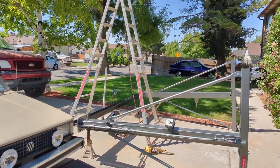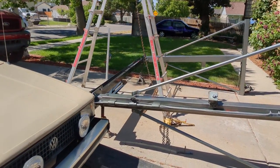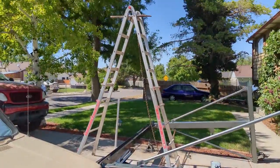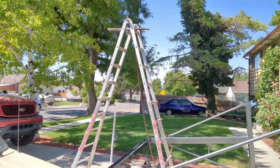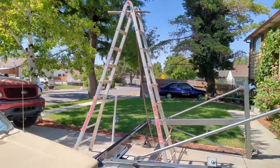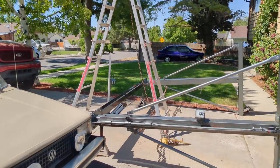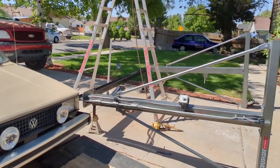I'm actually not going to lift it from the top beam - I'm going to lift it from a chain anchored about two and a half feet down. That way, because anytime you use a come-along or a chain hoist, you're going to run out of room at the top. At the very top I have a bar spread over the rungs and a piece of metal on each rung to help protect the aluminum rungs. I think two guys could bench press this, but you'd quickly run out of height - so we're just going to use the hoist.